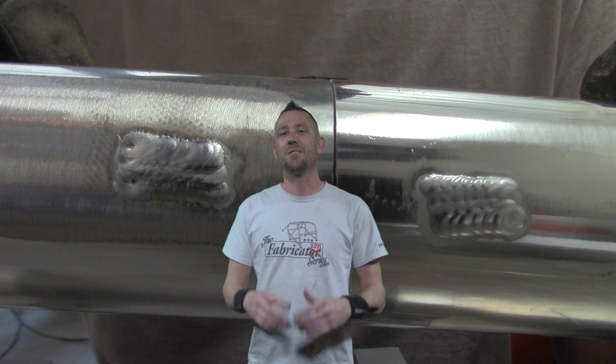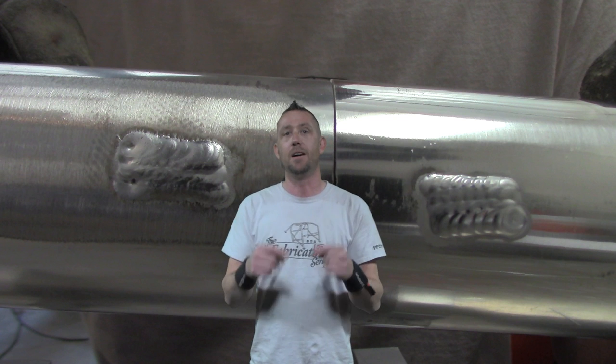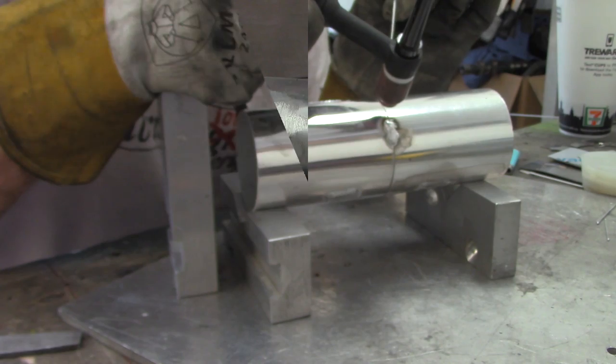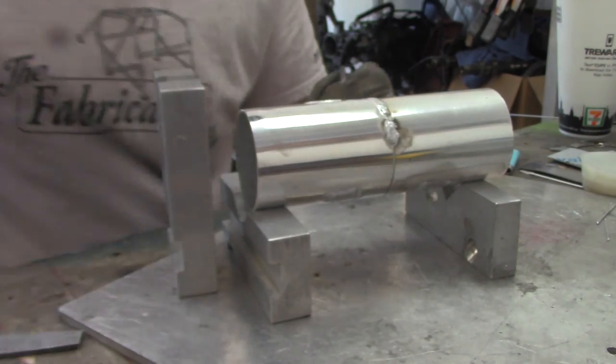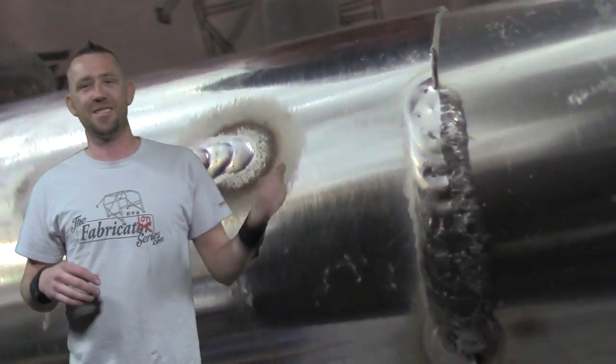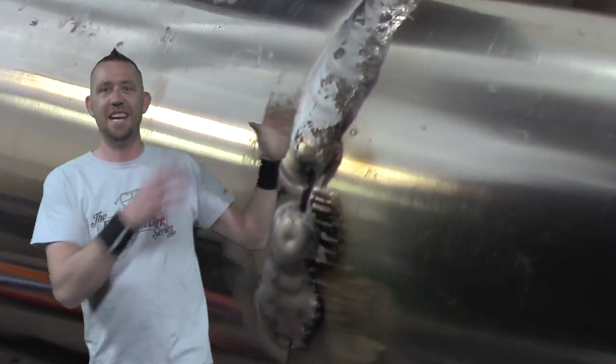For fun, let's do another one — take the two pieces again, no prep, and try to do a butt weld to get them to stick together. I'm going to concentrate all of my heat on the Mystery Metal. The Mystery Metal is on your left and the Verified Metal is on the right. Even though I have concentrated heat on the Mystery Metal, through that anodized coating it won't actually go through. So my Verified Metal is starting to burn away badly — I'm stuffing rod in there, I even contaminated the tungsten. The result is just absolutely foul. Please don't judge me too hard on this weld — this is definitely not my standard.